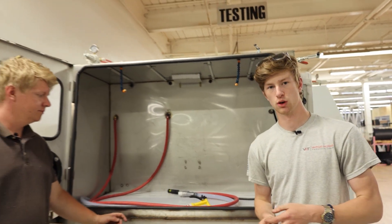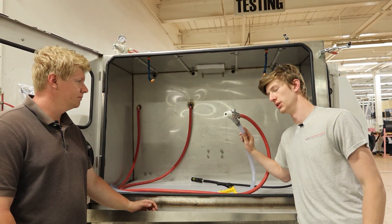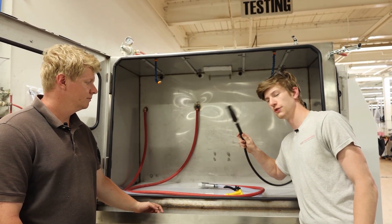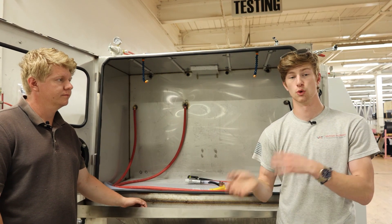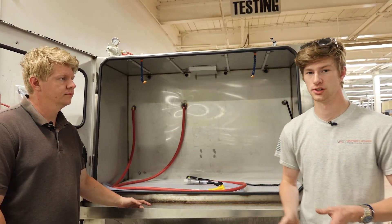This machine really is the best of both worlds. It comes with the high-volume slurry pump so that wet blasting will be as efficient as possible, and it also has that hydro blast for taking off grease on the first few passes. We've actually been doing a lot of testing here recently, and it's proven that if you hydro blast a part before you wet blast it, not only does it do a better job of removing it, but you actually get better surface finishes.